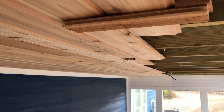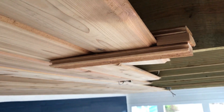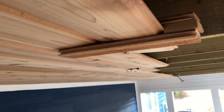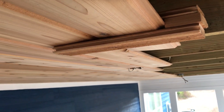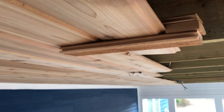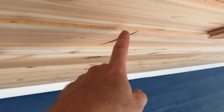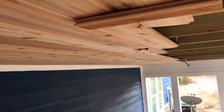What I wanted to show you — that I couldn't the other night — is these little clothespins. This is not my idea; I saw it from another guy on YouTube, but I want to share it so good information gets out there. These are a lifesaver when you're working on a ceiling like this, because you don't have a way to hold the board up while you work the tongue and make sure it's secure. On shorter boards it's not a big deal, but on longer boards — over about 7 or 8 feet — where you can't support the whole thing with your own wingspan, these are critical. I only managed to put up one or two full 12-foot lengths; the rest I had to cut to fit or to stagger the joints so two don't land back to back.